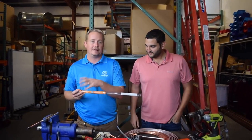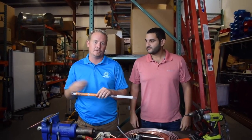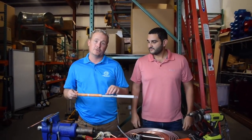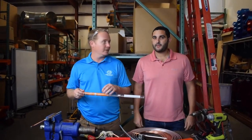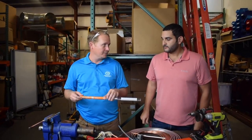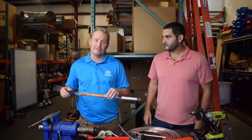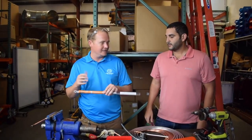You can use it to connect aluminum to copper, either whether the aluminum goes into the copper or the copper goes into the aluminum. You can also use it to patch aluminum or copper, especially pertinent when you have copper that's near aluminum. Aluminum starts to disappear on you at about 1,200 degrees and a lot of the copper rods start to flow at about 1,200 degrees, so that's incompatible.